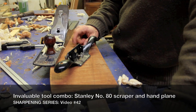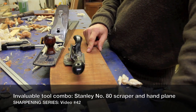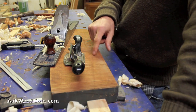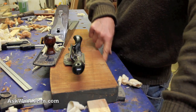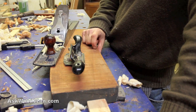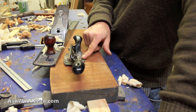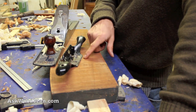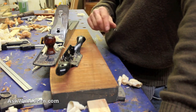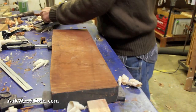Here's a drop of 8-quarter mahogany Sipo, and I'm going to scrape it real quick first to remove some of this rough surface. It'll also help me determine which way the grain is running, because I couldn't really tell — especially in these ribbon-stripe boards, it's a lot of times difficult to tell until you actually start cutting into it. So I'm going to scrub a little bit off with the Stanley number 80, then come back and do some surface smoothing with the hand plane.